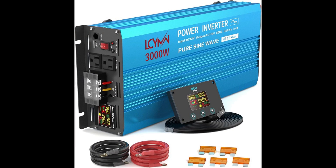So it's important for you to size your system correctly. Throughout this series I talk about how you don't want to buy stuff two or three times because you decided to upsize your system. But in the case of inverters, it's actually probably a better idea that you not oversize your inverter because that draw can be quite significant. Purchasing a 3,000 watt inverter will run everything in your house, no problem — but it's also going to have an idle load of about 100 watts. That's a lot of juice. Take 100 watts times 24 hours — that's 2,400 watt hours — you're burning up a lot of energy. That is many hundred amp hours of storage that you're going to have to have, and a whole lot of solar to recharge it.